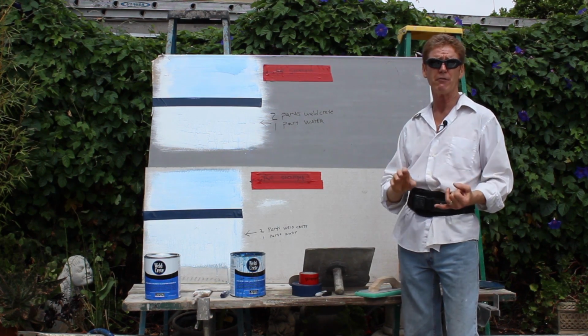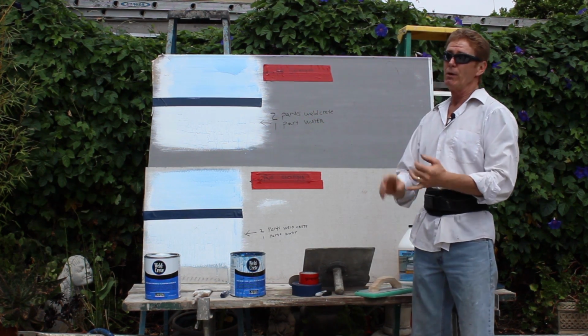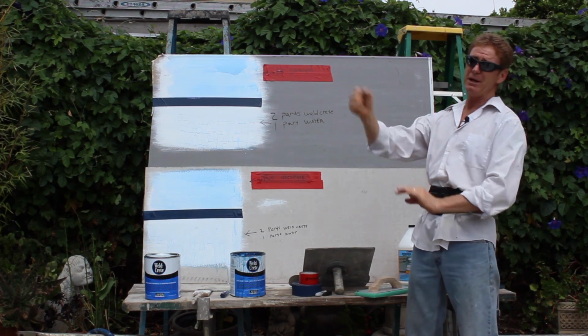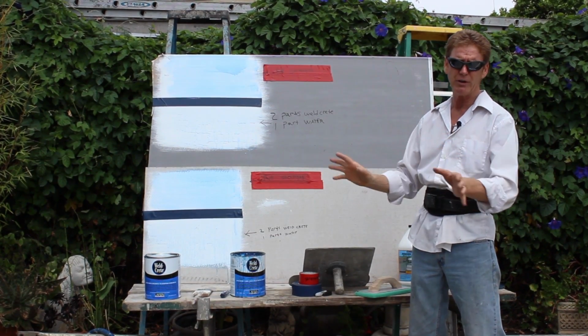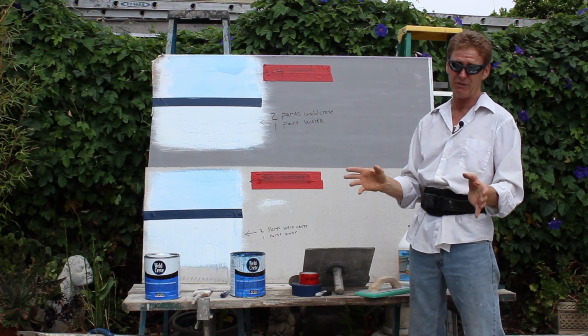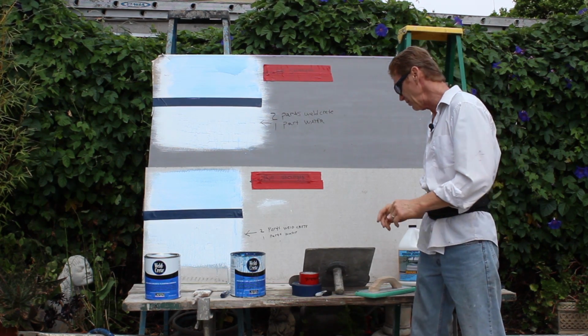Now, we do a lot of maintenance-free finishes. That means instead of painting the house, we pressure wash, put a bonding agent, and we apply a maintenance-free finish, 1/8 of an inch thick. And when I say maintenance-free, it lasts forever, doesn't come off. The colors start to fade in 30, 40 years. And that way it hides all bad finishes and things of that nature.